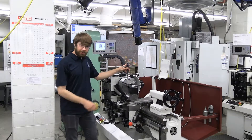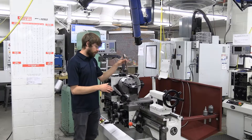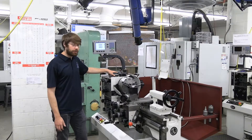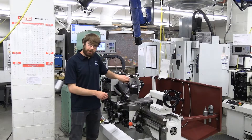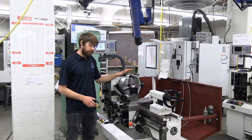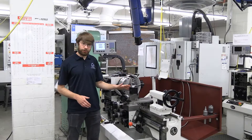The biggest thing is to never leave the chuck key in place. Whenever you're done with it, make sure you pull it out of the chuck and put it back on the headstock out of the way of the machine. You also want to be aware that all three jaws are rotating with it, so keep in mind that you need proper clearance with the tool holder. You don't want any part of the chuck to hit your tools.